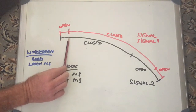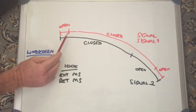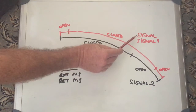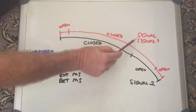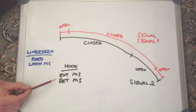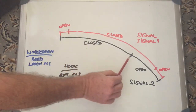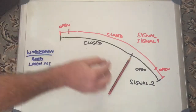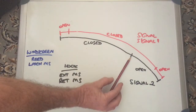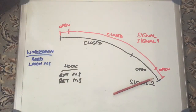What I've noticed is that when the roof retracts, it gets to about this point and this is where it starts to retract the hook. I expect what's happening is when it's moving, it's waiting for the signal from signal and signal one to say 'I have moved away from the windscreen — now retract the hook.' So that retracts as it starts to move back, and it gets the indication from the retraction microswitch to say it's fully retracted. It wants to make sure it reaches this position with the hook fully retracted, and it won't go any further with the hook extended — because obviously it's going to strike things on the way back if it's not fully retracted by that point.